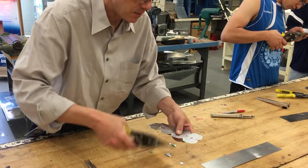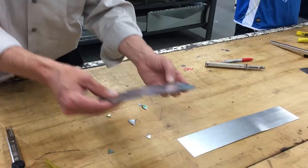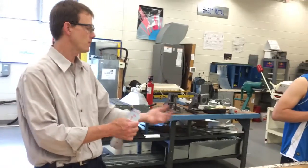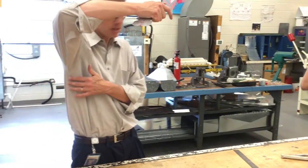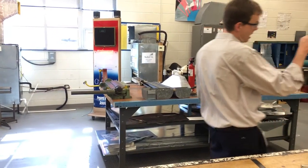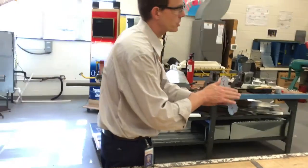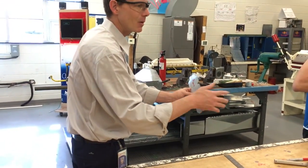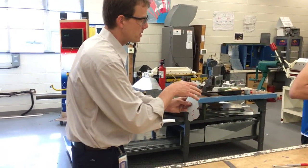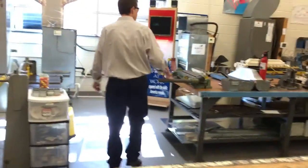So I did the tip on that last one — you can see there's a little jagged bit. Just be careful that it doesn't cut you. What do you got on the edge of your shirt to keep all the string from unraveling? A hem. So we're going to do a hem bend. Just like you don't want to rub the edge of the metal right there where it's real sharp — actually a dull edge will cut you worse than something sharp because it rips the skin instead of making a clean cut. So we're going to fold that over to make a nice edge. This piece right over here is a hem bender, and it's already pre-set for you at a half inch.